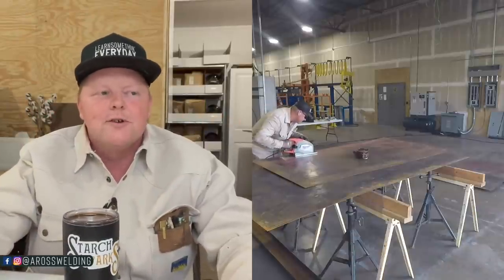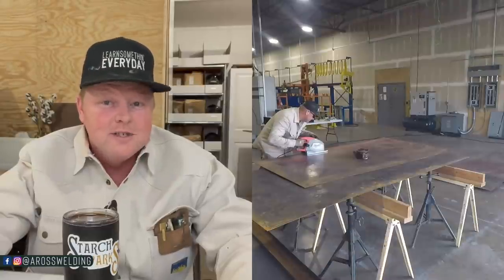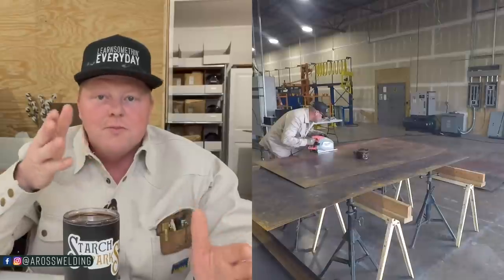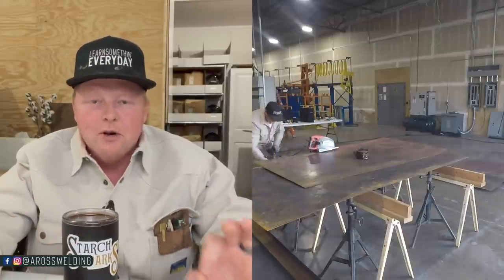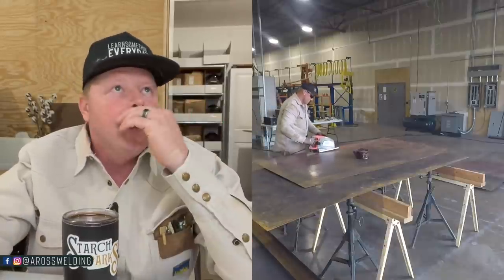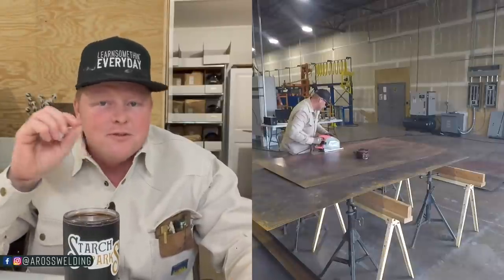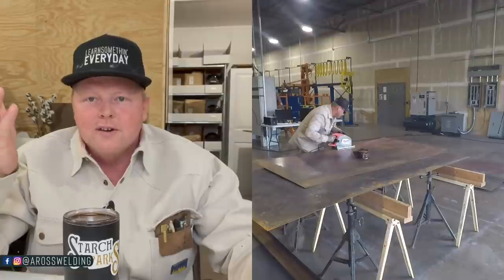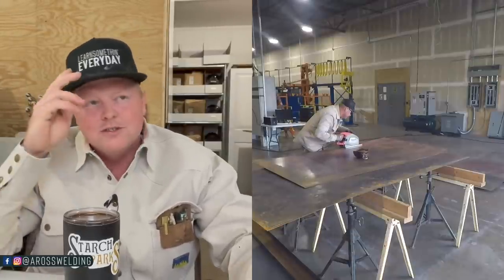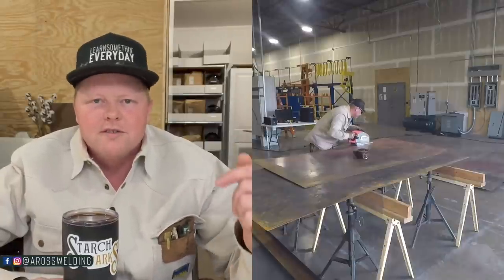This saw is a game changer if you're going to be cutting plate. My buddy told me you can cut three eighths or half inch plate with it. Some of you have commented saying you use this type of saw to cut stair stringers. The thing I like most about it is the cleanup - I cut four sheets, two cuts on each sheet, in less than an hour, and never even touched it with a grinder. With a torch I still would have touched it with a grinder, probably taking at least an extra 30 minutes. We'll put a link in the description.